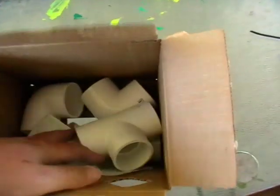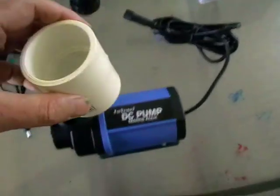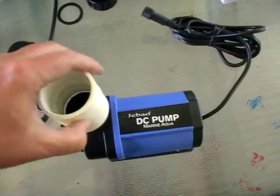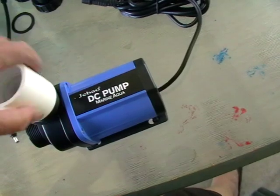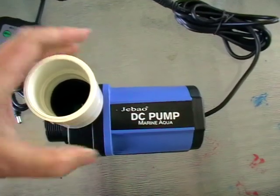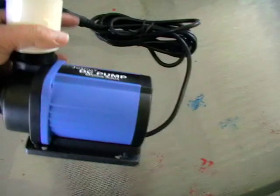Now the test will be fitting the plumbing. I've always got a box of plumbing fittings. A 40 mil screw coupling — your standard $2.50 piece. And in theory — uh-oh — in theory that should go on. Ah, there we go, we have it. So that's a 40 mil coupling, and the system I'm running now means I'm going to be able to run up the pipe size.